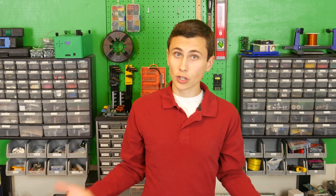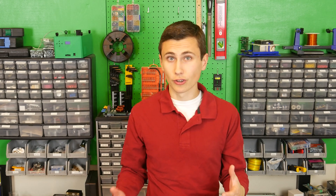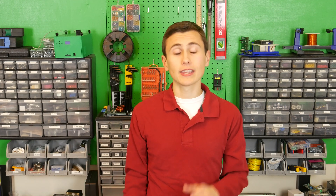The reason why we can't use an off-the-shelf bobbin is because we want to leverage a split bobbin, which makes achieving isolation much easier between the primary and secondary windings. It will also allow us to make the primary windings more symmetrical, and symmetry is difficult to achieve when you start getting 60 strands of magnet wire involved. Having that fixed form to wind each primary winding in will help us out a lot.